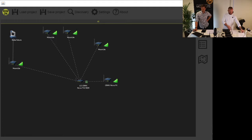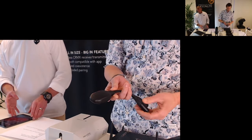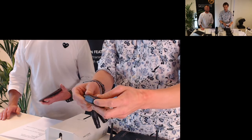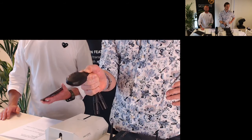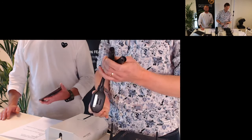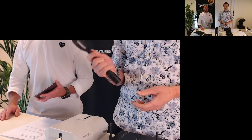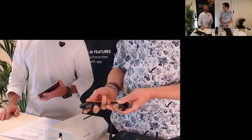Let's move into the Moonlight. The Moonlight is a battery-powered device that you charge using the micro USB connector. It has two DMX connectors — both in and out. It has a one-button interface for linking and unlinking, but it's also usable with Bluetooth. This little guy has both Bluetooth and CRMX. You can feed it with DMX or Bluetooth, and it will output wirelessly and on the DMX connectors. There's only one radio module for both CRMX and Bluetooth — that's quite unique — so you don't need any bridge and it doesn't interfere with itself.